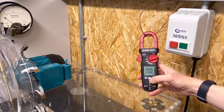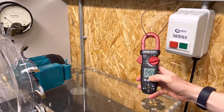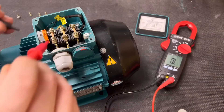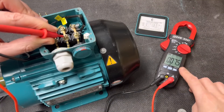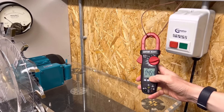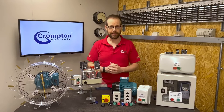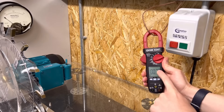However, one of those laws of physics — namely Ohm's law — means that the current flowing into an AC motor will be really high for a few moments before settling down to a lower value. This happens because when the motor is connected to a supply there's effectively just a coil of copper connected across the live conductors. This coil has a low resistance, so Ohm's law says a high current will flow. We refer to this high initial flow of current as inrush current. After a brief period of time the coil starts to generate inductive reactance, which combines with the resistance of the coil to create impedance. This impedance represents a higher opposition to current flow, so the current settles down to a lower value.